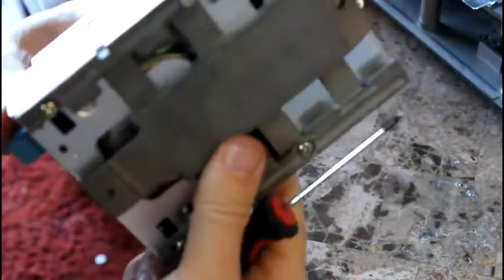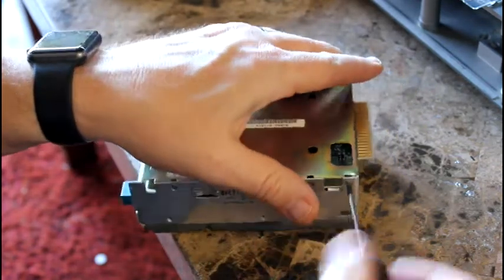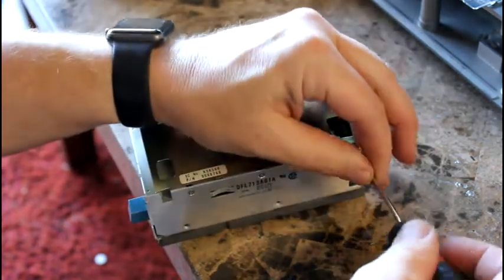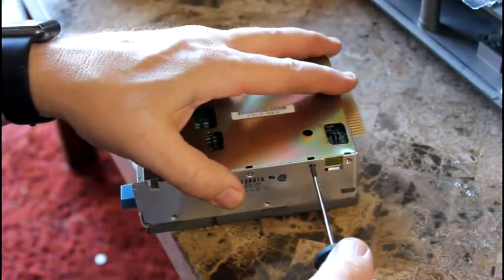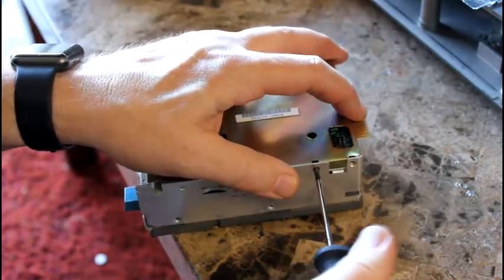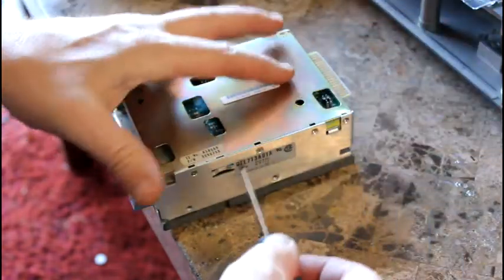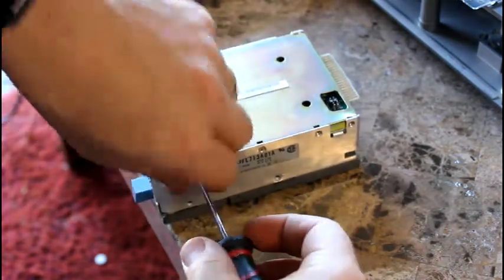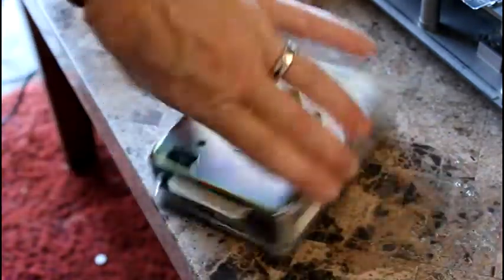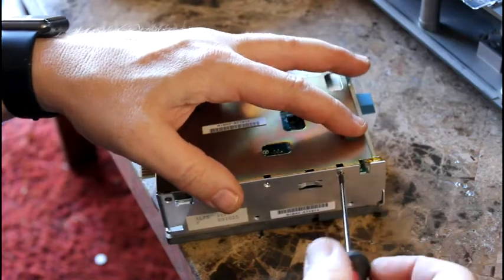Let's find out why. On the other one it was two surface mount capacitors. I have a feeling, with any luck, there'll be the same problem with this one. I got this one actually hoping it would work when mine didn't, before I knew how to repair it. By the time I got it I realized chances are it wouldn't work, and it didn't. But that's okay — I fixed the one I had, let's see if we can fix this one.